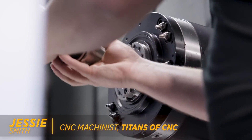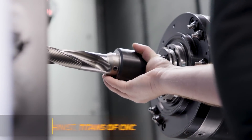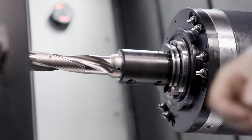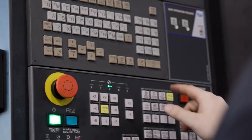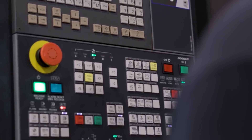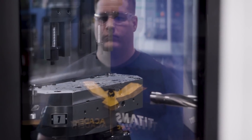So as you're machining and it is producing heat, that heat has to go somewhere. And if your tool is producing a chip that is too thin, then it has nowhere else to go except for into the tool or into the part. But finding that perfect chip thickness will transfer that heat into the chip itself and out of the tool or your part.